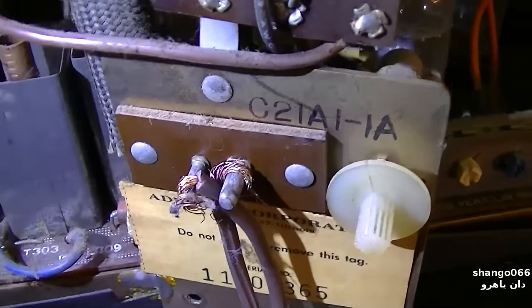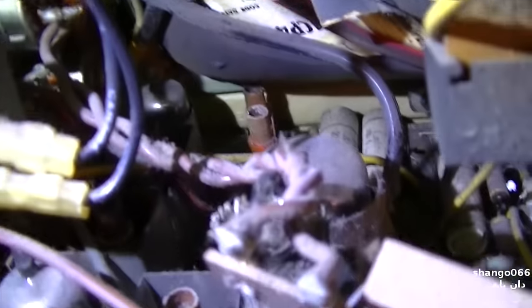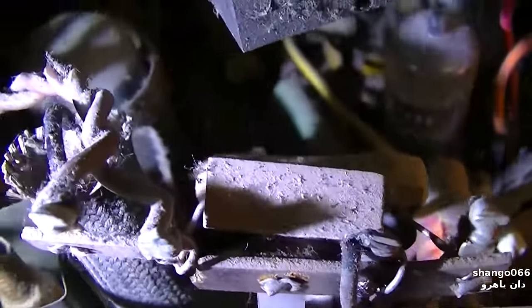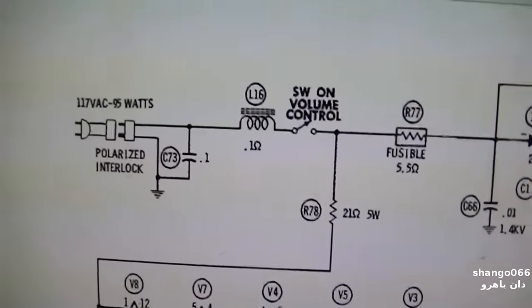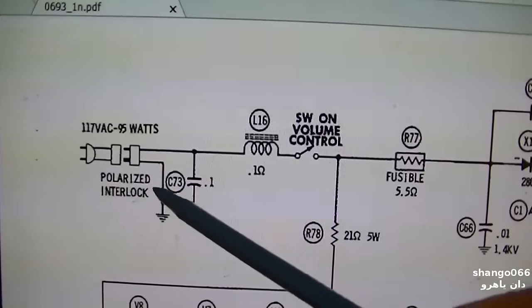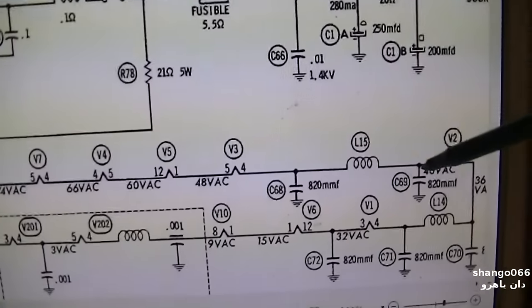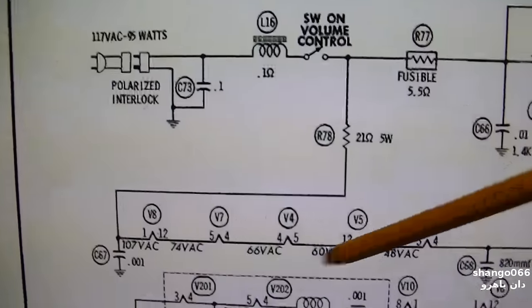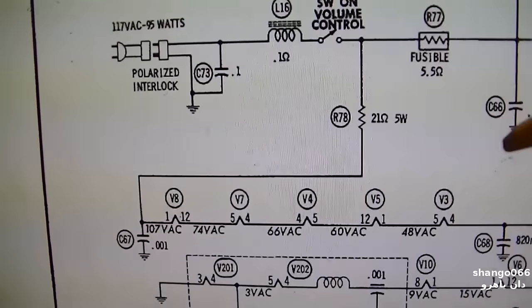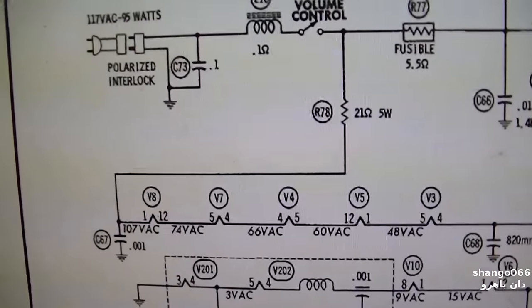The small pin goes through this — there's an inductor in the sleeve here, a choke — then it goes to that brown wire which is the power switch, goes over to the power switch, comes back from the power switch, goes to these two resistors. You can see there's a modern one there and there's a sand resistor back there. Both of those are good. Looking at this, you can see that we get the big plug tied to the chassis. These resistors are good. I need to find out where the break is here. It could be a cracked solder joint, it could be a bad socket.